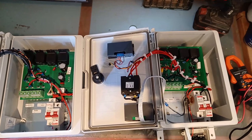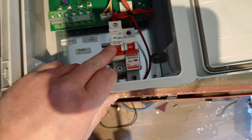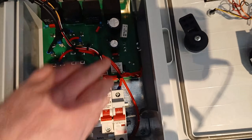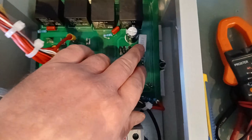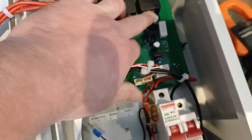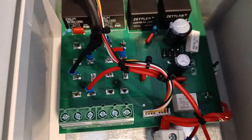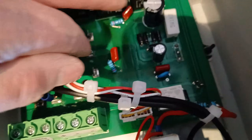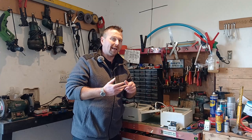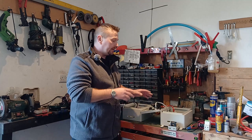If we pan out and look at these two units, there's very little difference between them. The old 24 volt has a 32 amp circuit breaker on it; the 48 volt has a 63 amp. There's a 1 kilohm resistor there — looks pretty much the same. The key difference I see is the size of the capacitor. In the 48 volt the capacitor is much bigger: rated 200 volts, 270 microfarads, whereas the 24 volt one is 100 volts at 470 microfarads. So looking at these two, it's safe to say that if you're handy with a soldering iron, had the specs and some parts from old electronics, you could convert your 24 volt charge controller into a 48 volt and save yourself 300 euros.